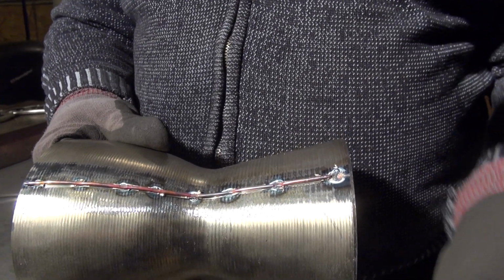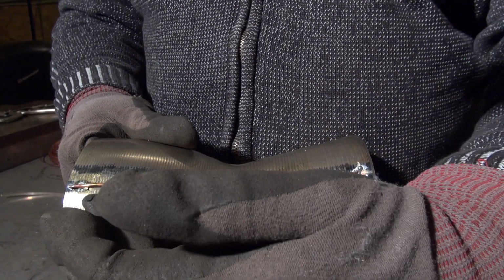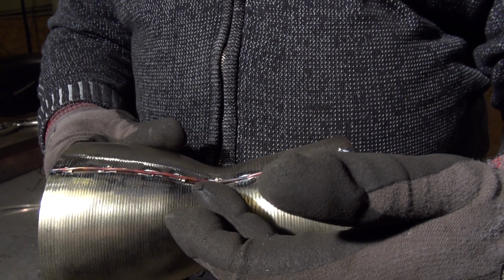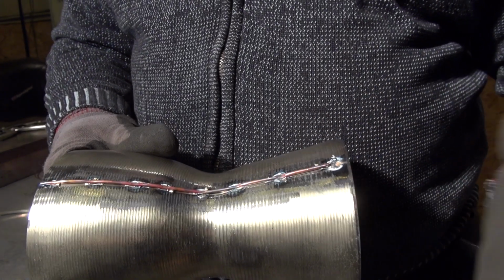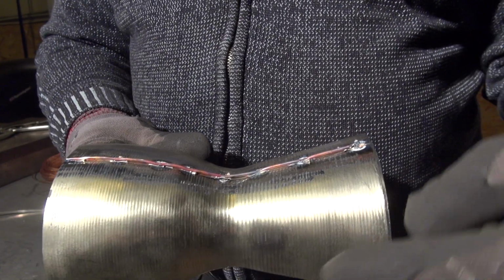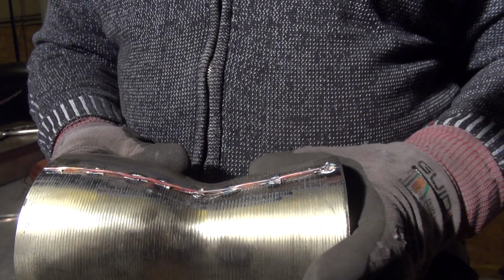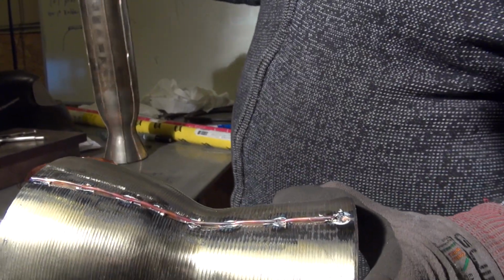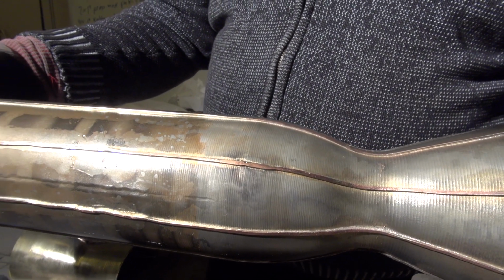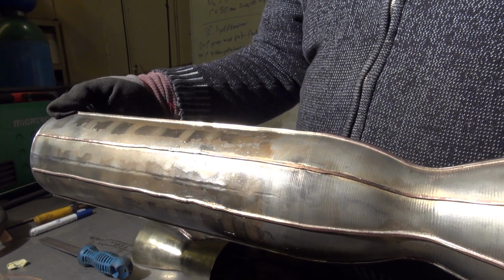Now what I have here is just one strand of copper spacer, which is joined to the liner, and I still have the silver solder strip material squeezed and sandwiched in between underneath. Now what's going to happen when I take this to the ceramics oven is that the silver solder material will melt and then even out underneath this copper wire and actually produce the result we have here. This is a much faster and much easier process, and we're probably going to use this for the next BPM-5 engines.